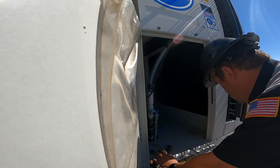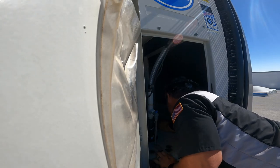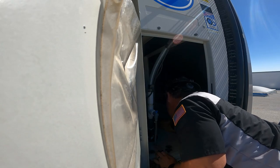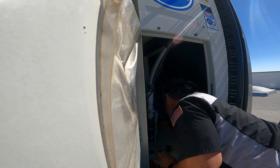These condenser coils are slightly oversized, therefore the fan speeds are on 15 to 18%. Today you probably won't see it reach above that because the humidity is so low and the inlet air is just around 65 to 68 degrees blowing right into that coil. It's just a wonderful, beautiful day on the inside of this condenser here. So let's get back to the video.